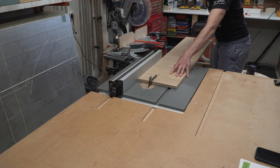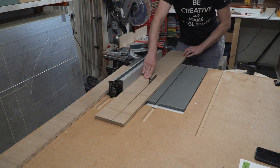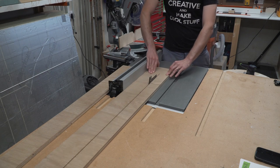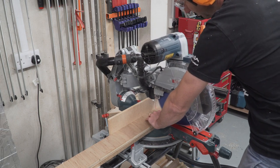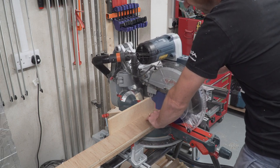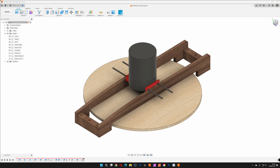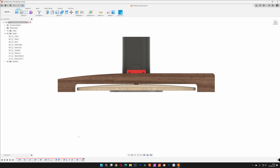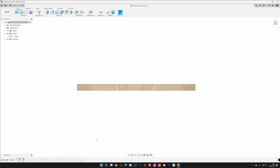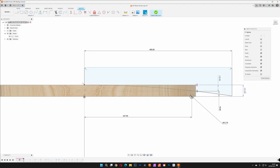So let me try and explain our idea. Our concept for the jig is to have two curved rails above the fire pit cover. The router will move along these rails to cut an arc. We'll mount the cover on a bearing from the lazy susan so that it can rotate. We'll then create the dome by setting the router at a point on the arc and spinning the cover one revolution, then moving the router up the rail a small amount and repeating. By doing this enough times, we will create a dome shape. This is where CAD modelling really comes into its own — we can throw all of our critical dimensions at a drawing and the geometry will dictate how we need to make the jig.